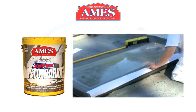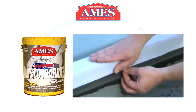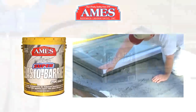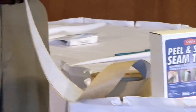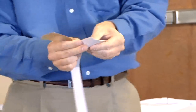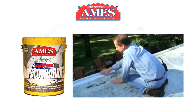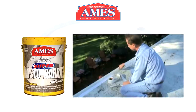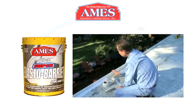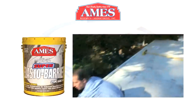This is a peel-and-stick rubber seam tape that we manufacture for around vent pipes and protrusions — it's called Ames Peel-and-Stick Contouring Rubber Seam Tape. It's got a self-adhesive back to it. It'll contour around flashings. Anywhere you have dissimilar materials that expand and contract at different rates, you use the contouring seam tape to bridge that and keep up with the expansion and contraction. It has a poly fleece outer so the coating can penetrate into the tape and become an integral part of it.